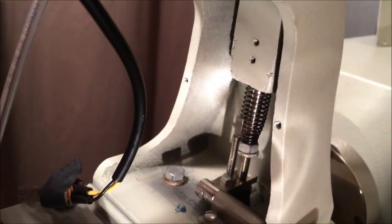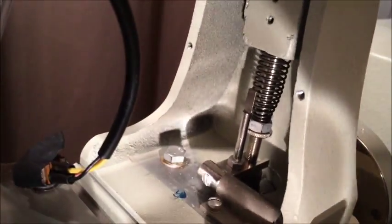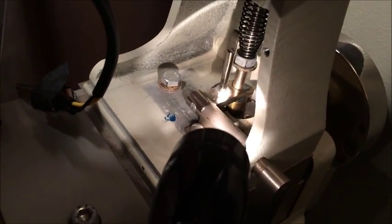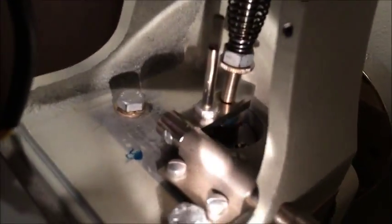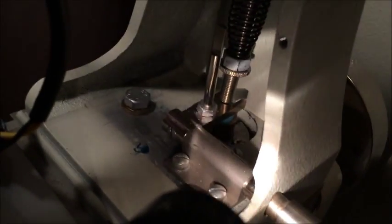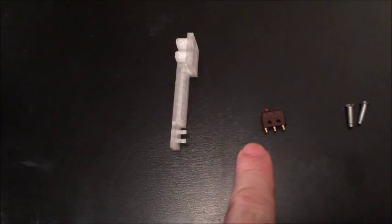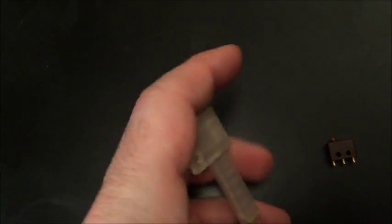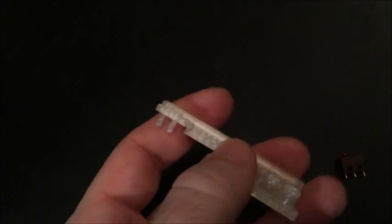You can see I've removed the reed switch assembly from the carriage arm. I'd like to point out that this is how you can determine what kind of half nut you have — you see down there I have a circular collar, that brass piece at the bottom. With the lever pushed to the back position, the half nut is fully up and you can actually see it peeking out of that collar. Mine has almost a bluish color — that is my original Neumann half nut, and as you can see mine is circular. So I've got the original screws, this micro switch with the proper voltage and amperage rating, and right here is the bracket I designed and 3D printed.